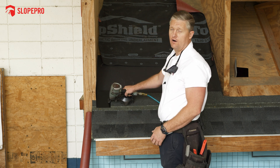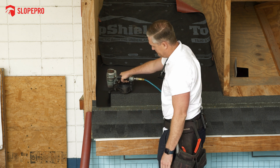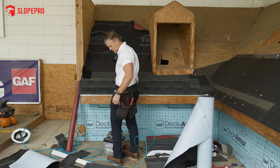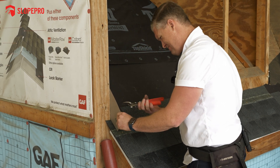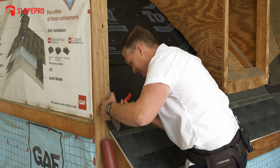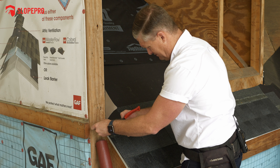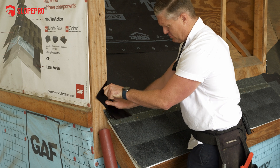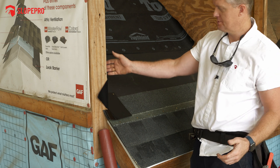Putting the nails in the right place seems like such a simple thing but it's such an integral part of the overall roof system - and there's about a million nails going into this roof. The nail should actually go here in the top corner of the step flashing. This piece of step flashing will actually bend around the wall, so I'll take my snips and cut this. It'll bend around the corner of that wall, and this will all be behind your siding - or if there's brick, you'll get a piece of what's called counter flashing that goes down over top of this metal to keep the top leading edge from leaking.